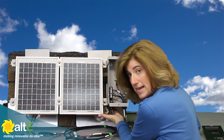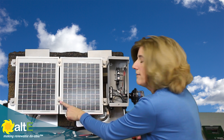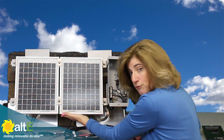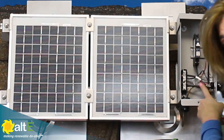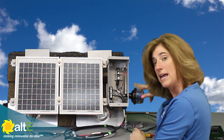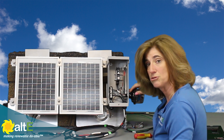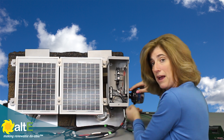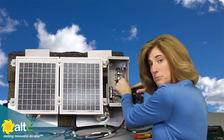I've already taken my ground that is connected to my racking. I've got my ground wire going from the rack, and I've got grounding mid-clamps from Iron Ridge bonding the frame of the solar panels to the rack. My ground runs from the rail into the combiner box to my grounding bus bar. I've also got a lightning arrester here, which will help prevent any damage from a nearby lightning strike. My negative from the lightning arrester goes to my negative bus bar, the ground goes to my ground bus bar, and the positive goes to my positive bus bar.